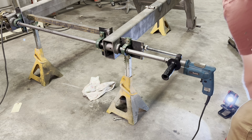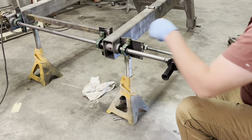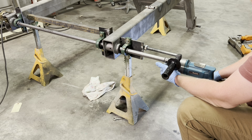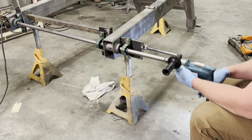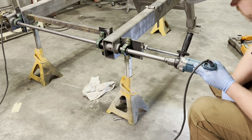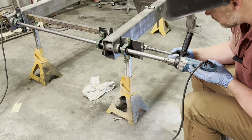Okay, during this cut, there's gonna be a lot of interruption, meaning the cutter is not gonna hit on all sides of the hole because it's not straight. So this is a real light pass just to get things going in the right direction. Then I'll make a heavier cut a little bit later. Well, this looks, again, really crude, but it works.